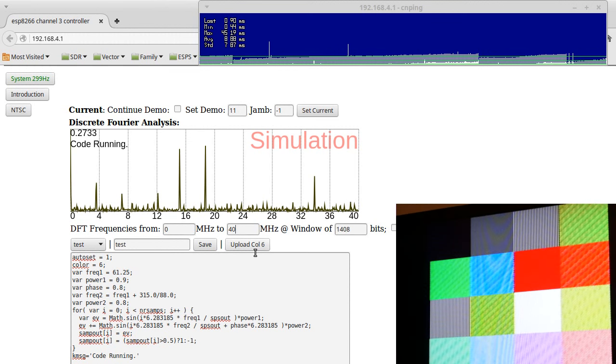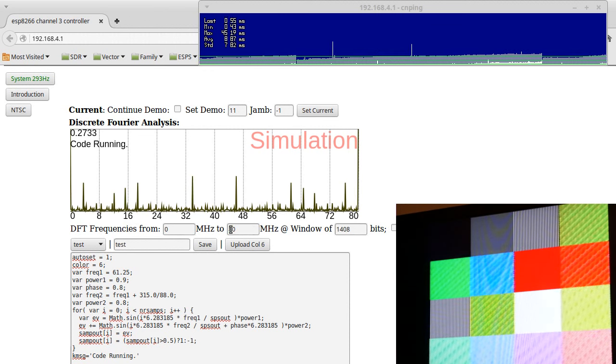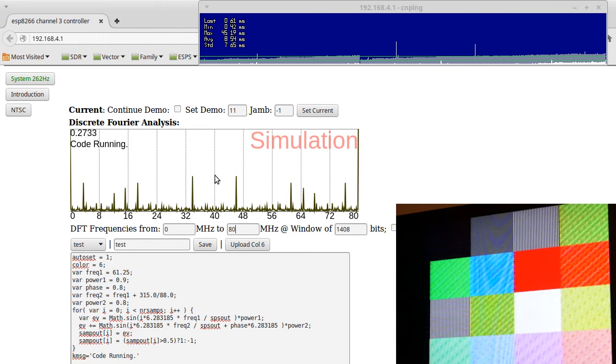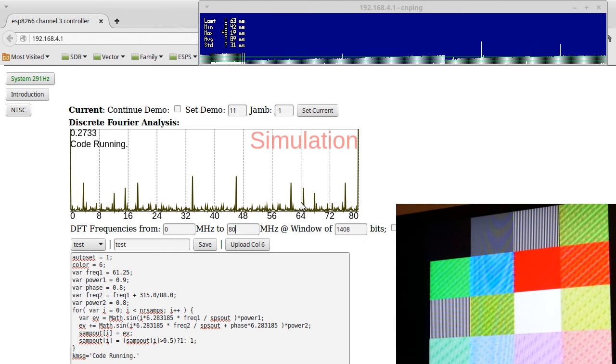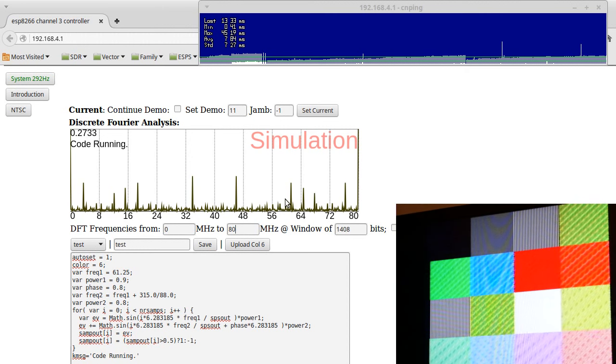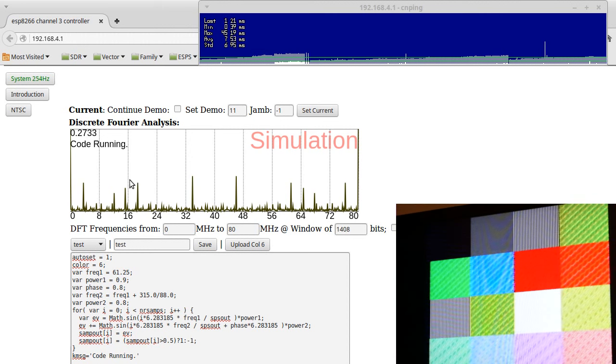It's because this is outputting a square wave over the I2S port. But if we go and look up to 80 megahertz, we're not just getting multiplications of lower waves. We're not getting overtones and things like that. What we're actually getting is the wave is mirroring around half of the carrier. So as you can see, this wave up here at 64 and etc. megahertz, these are mirrors, images of what is below. That's how the frequencies go that high.